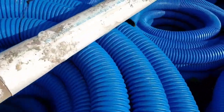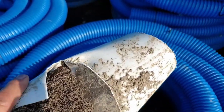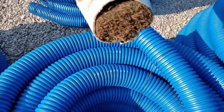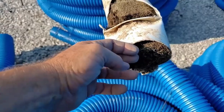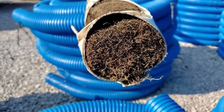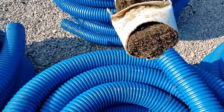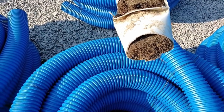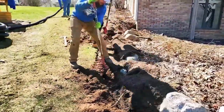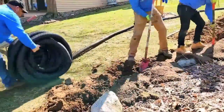I'm going to explain to you how the roots found their way into this system and how to avoid it. This happened during the removal — we had to completely rip out an underground downspout system and replace it, so somebody's hard-earned money was just wasted. They took the sawzall and cut the pipe out in pieces, but as you can see, it's just full of root. You're not jetting that out — it's just full solid roots.